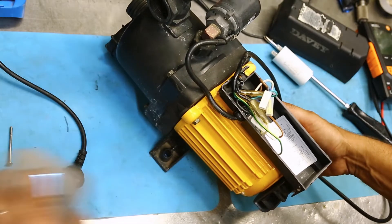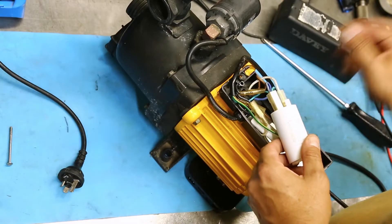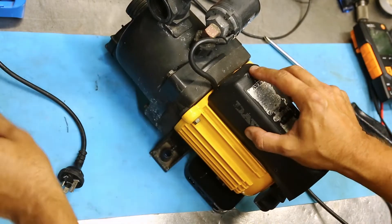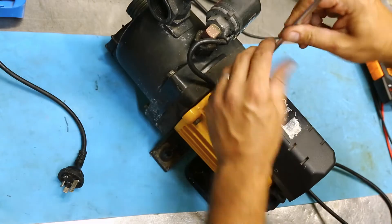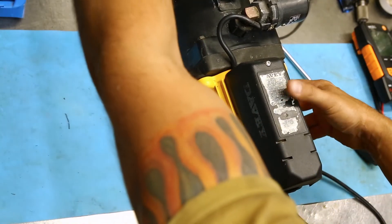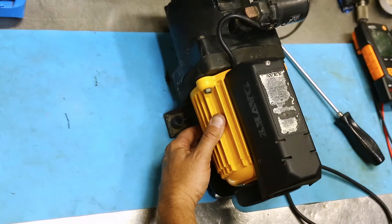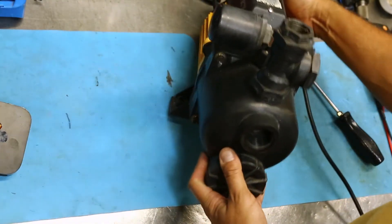I'll bring the pump back into picture, put the temporary stand back under it, put the terminals back on the new capacitor, drop it in there, set it all down nicely, and put the lid back on. Let's see what it starts up like now. There's just no hesitation whatsoever — it was hesitating maybe 200 to 300 milliseconds before, now it goes straight into action without blinking. I'd say we're fixed.